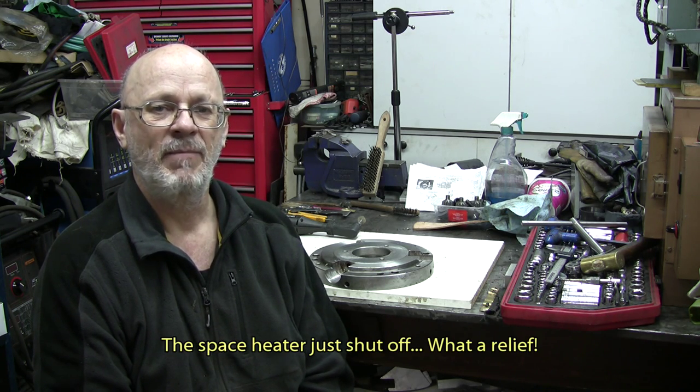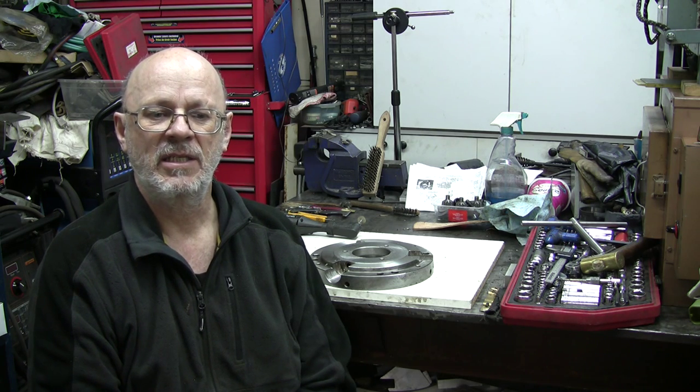I'm planning to do some welding, replace the missing metal, and the method I chose for that is I'm going to MIG weld. I could TIG weld, but I'm going to MIG weld for the main reason that you can apply a very high burst of energy with MIG, and it cools down quick. As far as the heat affected zone, the HAZ, it will be minimal. I will just go with small bursts, hot enough.